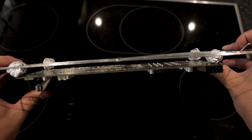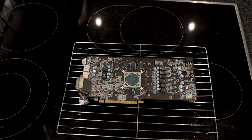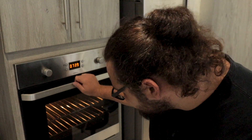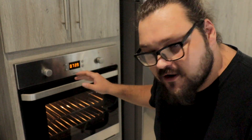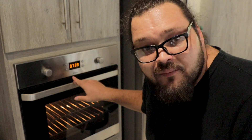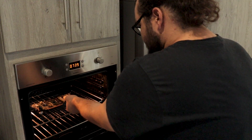This should keep our GPU lifted up from the grid itself, making sure not to actually burn the PCB. Now that we've got everything nicely set up and ready to go, you just need to wait a little bit for the oven to preheat a little more. It looks like our oven is preheated to 190 degrees Celsius or 370 degrees Fahrenheit, so I think we can pop this baby in. We'll leave it in there for about 10 minutes to bake — I'm probably gonna give it like 12-ish minutes just to make sure.